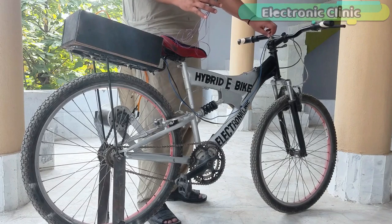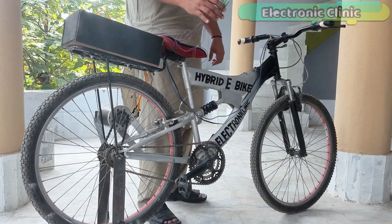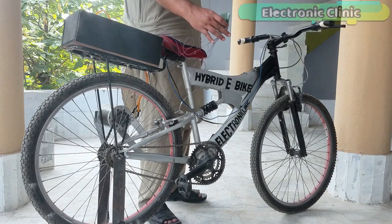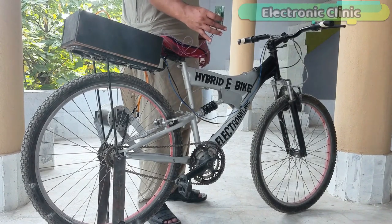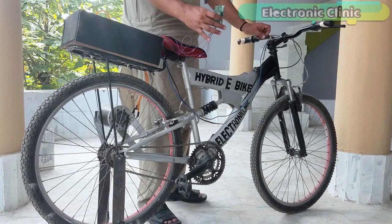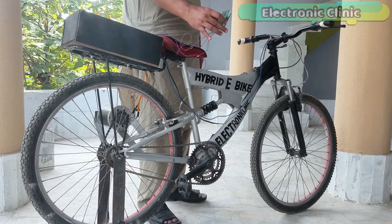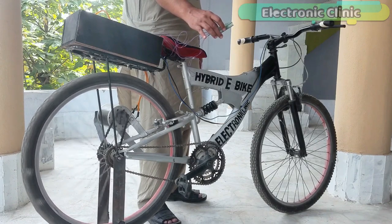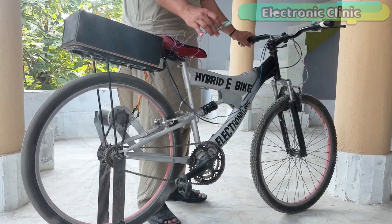When the value is less than 100, the automatic speed control system is deactivated. When the value is greater than 100, then the automatic speed control system is activated and the MPU6050 module can be used to control the speed.